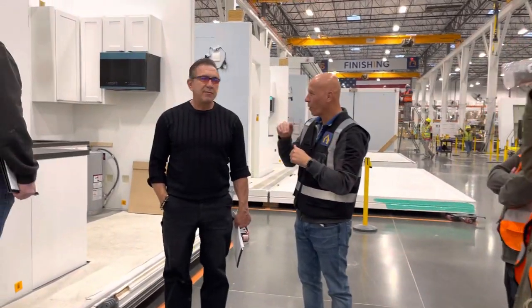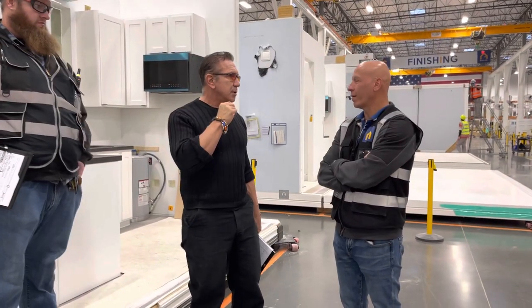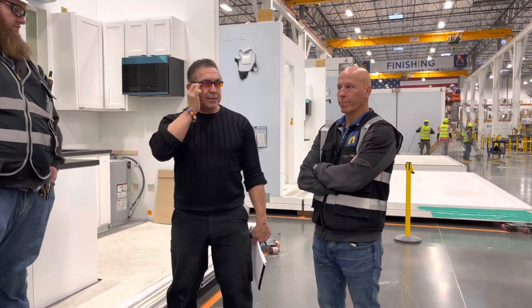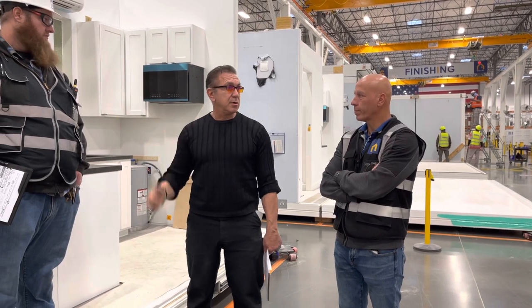It's because there's no overlapping, because it's vacuum formed, right? So you have to live with generous radius. Right. So if we can injection mold, all of that's gone. Yeah. But it's not possible.